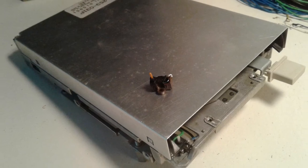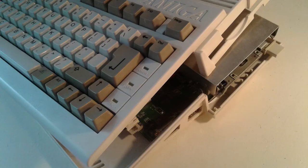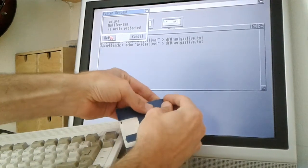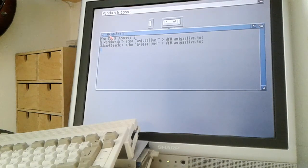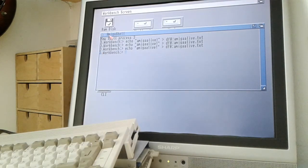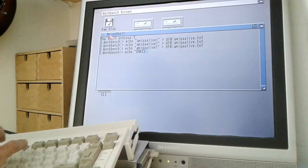Let's put a floppy disk into the drive and see how it looks. Very good! The rear pin gets pushed down nicely by the floppy, and the front pin sits almost perfectly centered in the write protection hole. Time for testing! We put our floppy drive into one of our Amigas — here we are using an Amiga 600 — and play a little bit with the floppy disk's write protection switch. This works!